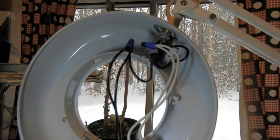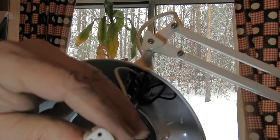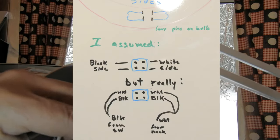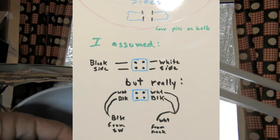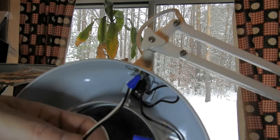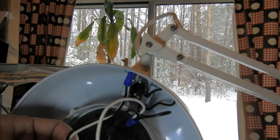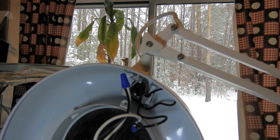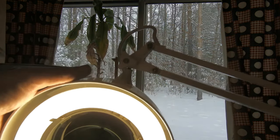Now I'll put this plate back in that covers the wiring and put the bulb back in. Starting to put it together, I realized that this connector doesn't go on the way I thought — it goes this way. The short on these two pins goes across the white and black on both sides. And of course I tried it and it shorted the line out again. So white and black have got to go to a black, and white and black have got to go to a white — they should have used different colors for this harness, like reds and blues. So another rewire, and I'm going to try it loose this time just to be sure. Let there be light! And it's a nice light, just what I wanted — a warmer light.